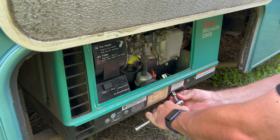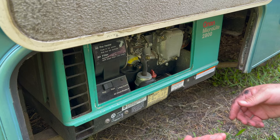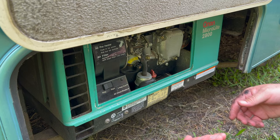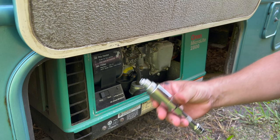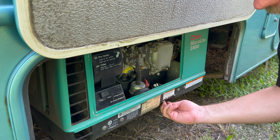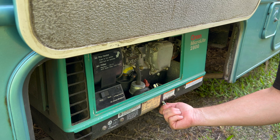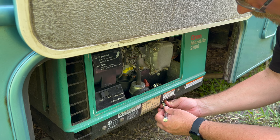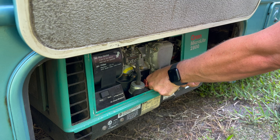It doesn't take much. You never want to over-tighten them. I like to finish the last part by hand — and there's our spark plug. Now we're going to gap our spark plug to 0.025. Now we're just going to reverse the order and put our brand new spark plug back in the generator, taking great care not to cross-thread. Do not cross-thread this — you cross-thread this and you are in serious, serious trouble. It should go in by itself. Once it gets tight, give it one good twist just to snug it. Now all we need to do is reconnect our spark plug wire. Spark plug is finished.